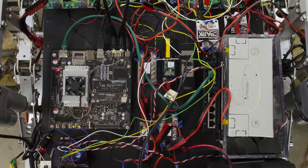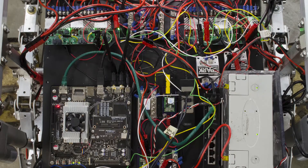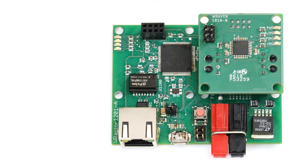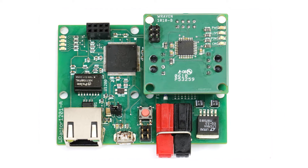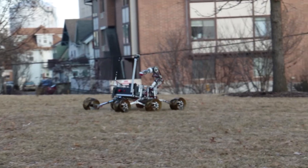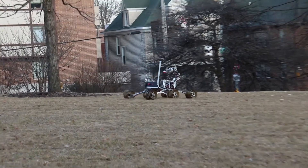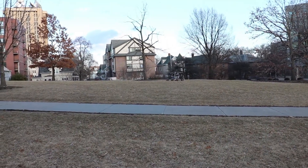The embedded system of Mark II has been dramatically overhauled with a focus on reliability and recovery. The computer, radio, microcontrollers, and IP cameras communicate over Ethernet, which allows the rover to recover from intermittent link failures due to vibrations or faults. The custom arm and drive microcontrollers have integrated Ethernet and power regulation systems and use the industry-proven FreeRTOS TCP stack for communication with the other systems. For communication with the base station, the team is using two off-the-shelf commercial radio systems at 900 MHz and 2.4 GHz. These systems have proven to meet the range and line-of-sight constraints of URC.